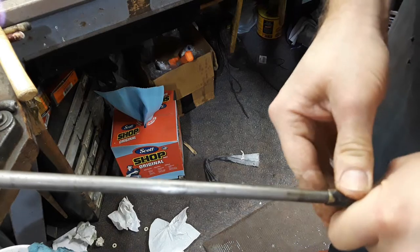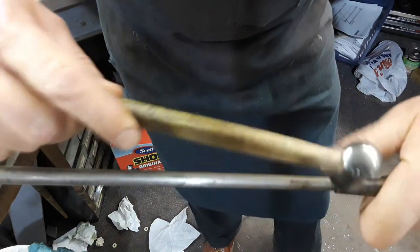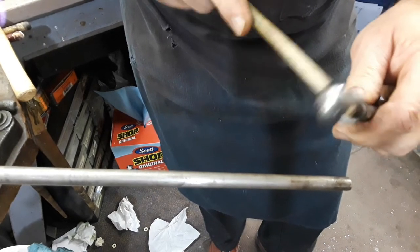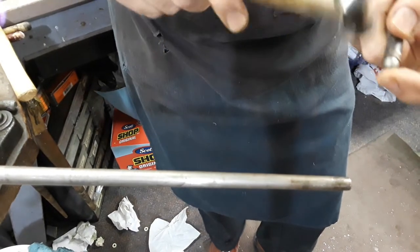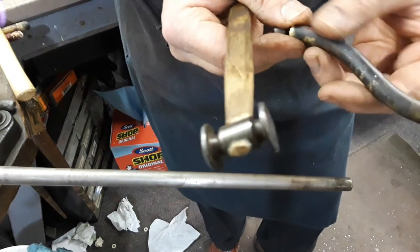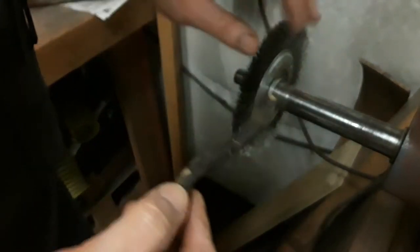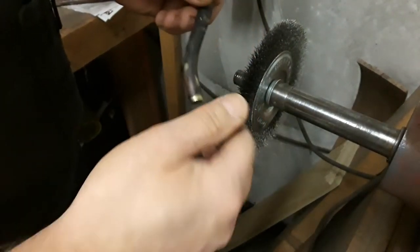I'll start with a drift punch and then go in there with the tapered rod and work that to round this out a little better. Starting to open up now — I think we can go to a dent ball. Let me just try this first. The brass is very soft because of being annealed. That dent ball will fit down in there now. It's looking pretty good. The fire scale from annealing tends to be pretty tenacious, so I'm going to go ahead and use a steel wire wheel — this is going to be an abraded finish anyway, so that's not a problem.